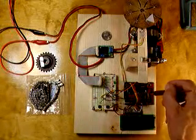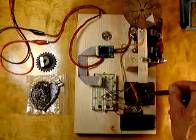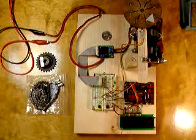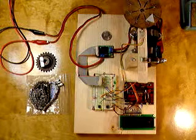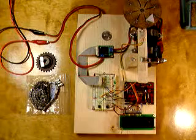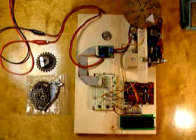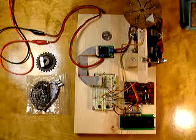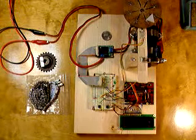This is Diabolino — it's an Arduino clone. The hall effect sensor generates an interrupt so that the computer can count the pulses, and eight pulses will equal one revolution of the disk. One revolution of the disk, since I have a 16 threads-per-inch shaft, will equal one sixteenth of an inch.